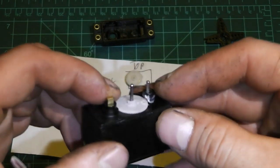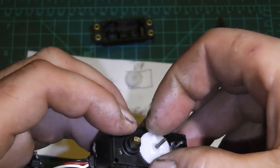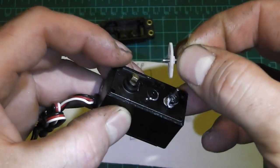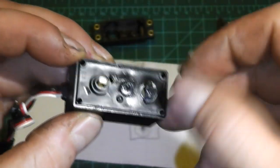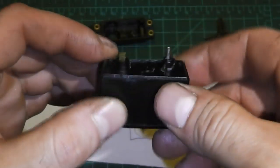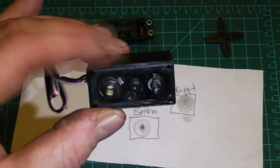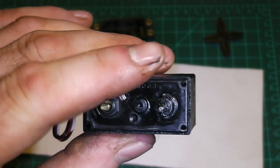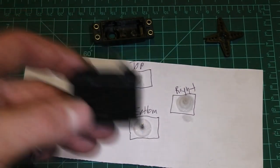Then this bottom one is tricky. Inside here there's a cutaway in the plastic with a gear protected inside. You may need something to get underneath this gear — I'll try my fingernail. You'll notice the post came out too; remember the orientation. So you can go in and remove all of the excess grease. This is white lithium grease, by the way. For plastic gears, try not to use petroleum-based grease products — don't use them on Delrin or anything that's not metal. Look inside every crevice and make sure there's no piece of nylon from the gear stuck anywhere, because in flight that could come out and you'll re-strip your gear and crash your plane or heli.